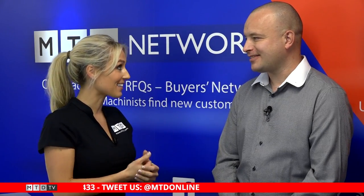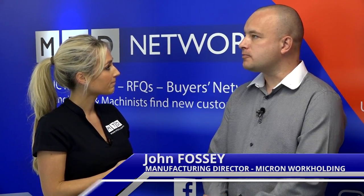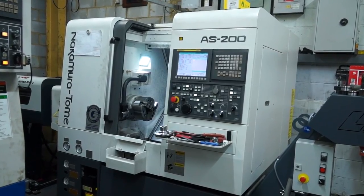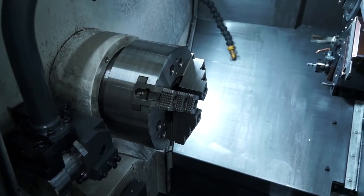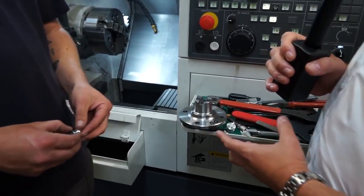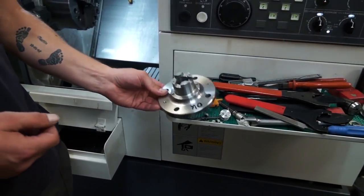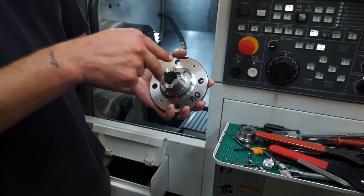We've got John Fossey here today from Micron Subcon. Thank you for joining us. John, you've been very busy lately. Can you tell us a little bit more about your machine shop and what you've got inside? We specialise in milling, we also turn. We've got a range of vertical machine centres. We have a Hardinge XR760 with full fourth and fifth axis. We have a Doosan DNM400, which is only a three-axis machine, but it's fitted with micro-lock hydraulic vices to enable us to hold numerous parts. We can turn up to 250 millimetres diameter.